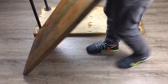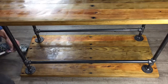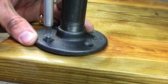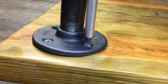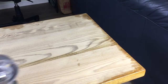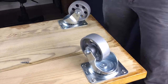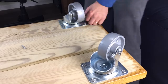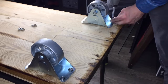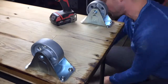Once the top is fully installed, flip it over onto the bottom and start screwing in the hardware from there. If an adjacent floor flange needs a little pressure to seat properly, push it into place and then screw it down. Once all flanges are installed, flip the unit over and start installing the wheels. The back side of your bar cart gets the swivel wheels and the front side gets the stationary straight wheels — if you put them opposite it'll be difficult to maneuver the whole thing around.